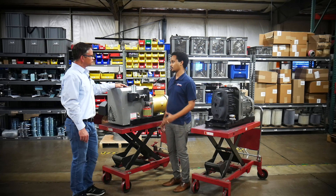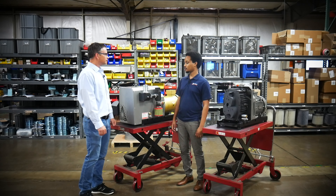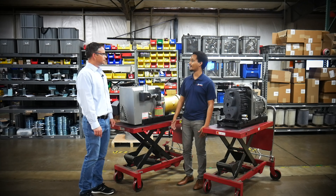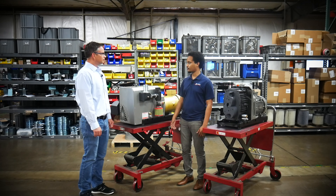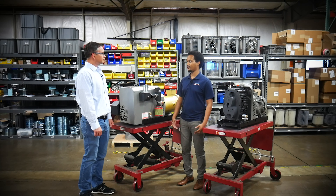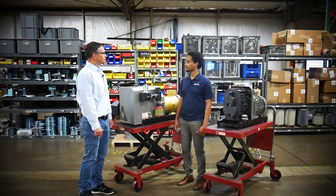Please explain duty cycle. This pump can handle a broad array of duty cycles. It can handle continuous duty cycle, meaning the pump is running at full vacuum non-stop. It can also be cycled — for thermal forming, for example, some people are cycling it over a few seconds. It can also be stop-start with a VFD, or it can be run every few months as in the medical industry.